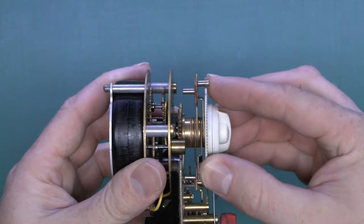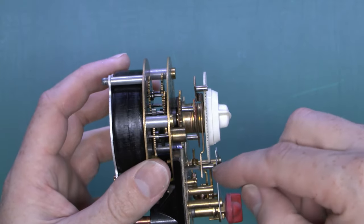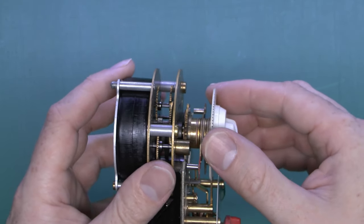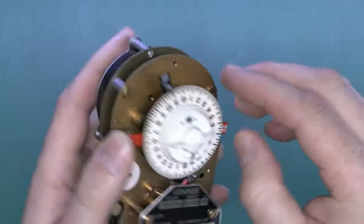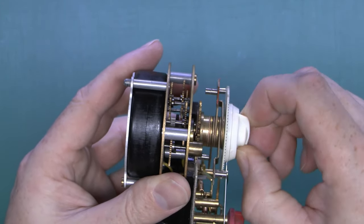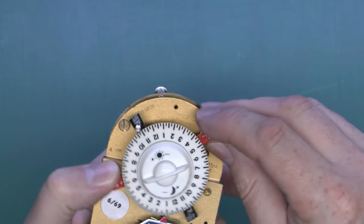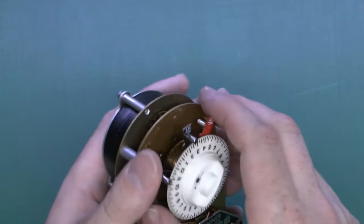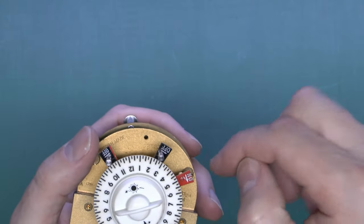As it gets to this point, the red pointer there has a pin on the back, and that pin actually goes through and then presses against the lever at the bottom there. The off one is very similar except the pin is in a different position - it actually sticks upwards rather than downwards. As that moves around, it just clicks the lever in the other direction. It's the same lever that you activate by the manual control on the front, and you can move the levers to whatever times you would like. This only has two on and two off, so it's basically two on and two off per day. You can slide those to whatever you wanted, and if you only wanted a single on and off per day, you can configure it by basically overlapping them to cancel out one of them.